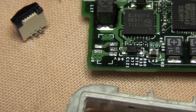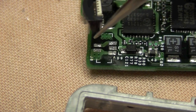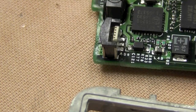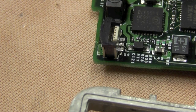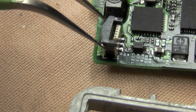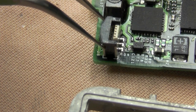Anyway, just to tell you briefly about soldering — the importance of having a clean tip on your soldering iron and obviously clean pads as well. Because if you're trying to solder up to dirty pads or you've got a dirty tip on your iron, forget it — you'll not do a good job, you'll end up with blobby work and possibly end up damaging the board. So clean your tip; always make sure that tip is clean.